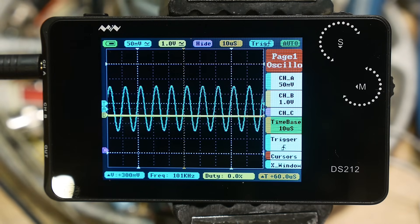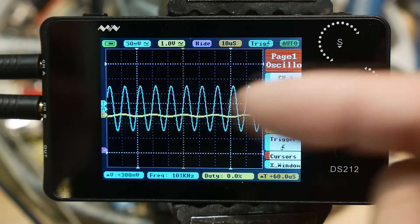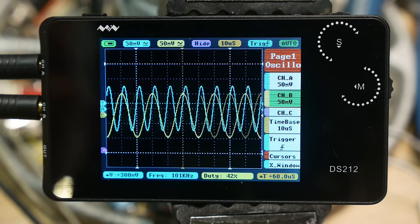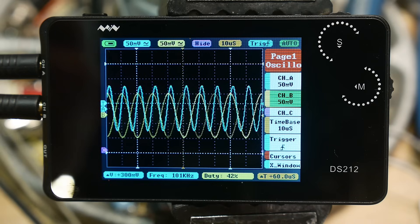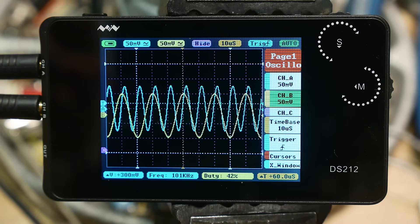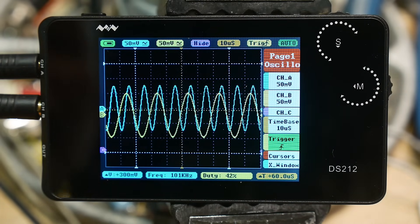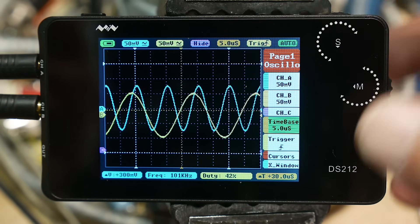There are two channels, so let's try to do a two-channel setup. Let's go to channel B - make that bigger. I have it running at half of the frequency and they're not phase related, so it's going to be jumping around a bit. This isn't a touchscreen - no, it's not. Let's look at doing triggering. I just changed the trigger level and everything got clean, so yeah, they are phase related. I can go back to the time base now and zoom out. That's nice.